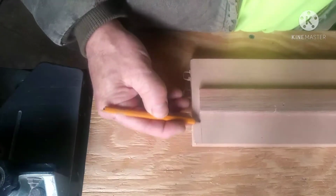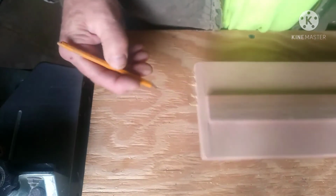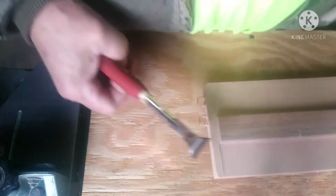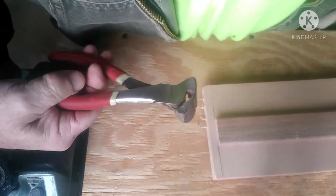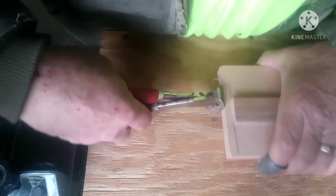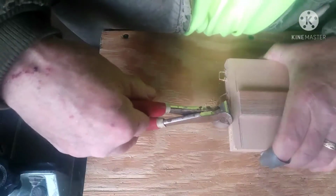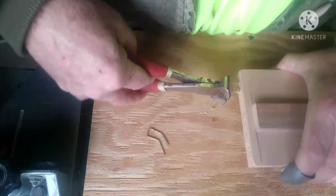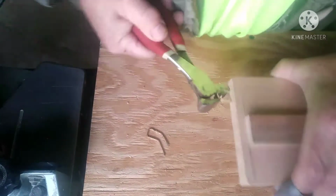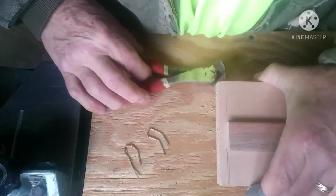The door stop is actually the right size of the opening that I need. So I'm just going to run my saw right up next to that door stop molding, but those staples got to come out. This close nipper tool here works great for these because it's got that roundy head. You can grab it nice and tight to the wood and rock it back and forth and get those kind of things out of there, or you can snip them off if they're really hard.